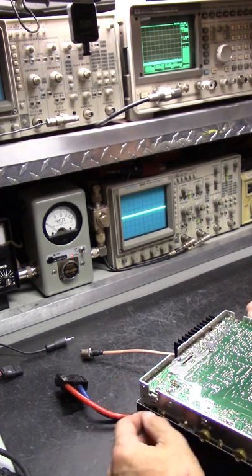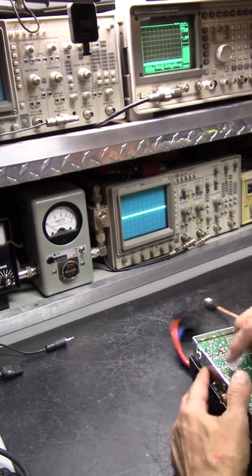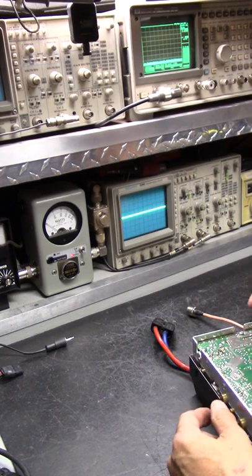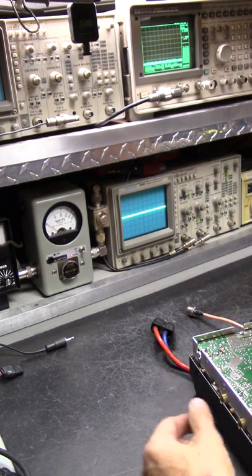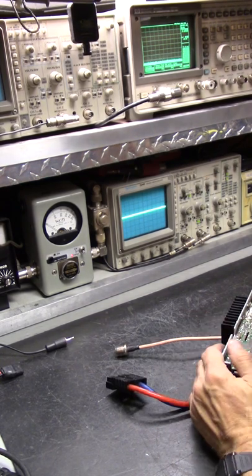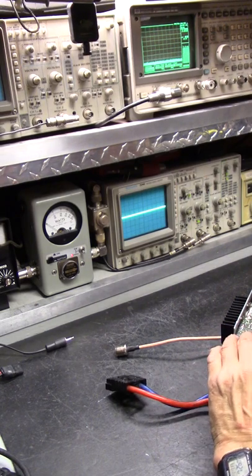Besides that, looks like the audio chip. This is an older one, one of the first ones. That's a TA7222AP audio chip. And it looks like a 360014/B board, one of the originals, with updated MOSFETs. Same regulator. I don't really see anything else that's been done to it. The solder joint may have been replaced.